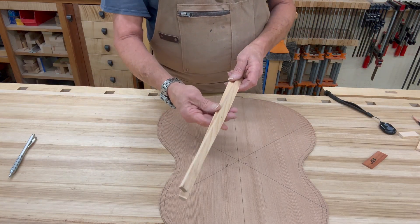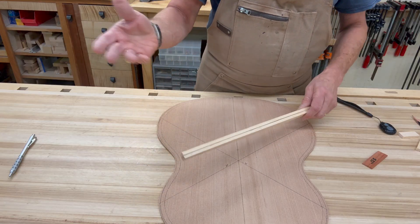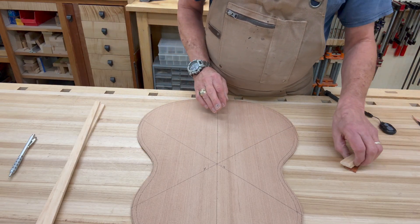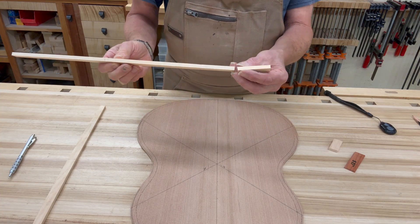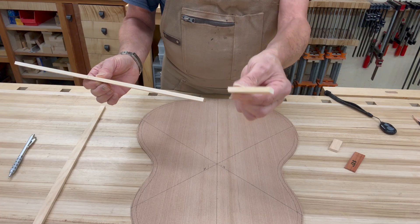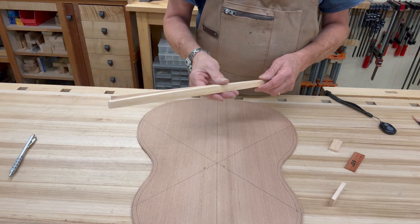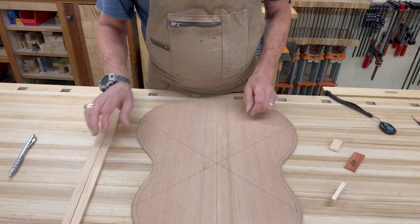Hopefully just much lighter lines so that they're easier to sand away or obscure by whatever means. So I have made a pair of X braces here, and I have them already arched to the doming that I expect to do, or perfectly flat if that happens to be your preference. Now what I'm going to do is cut a half lap joint on the table saw, and it relies on just two simple concepts. The first and most important one being that whatever the material thickness is that you have for your braces, you want to get that to your desired thickness and take a scrap and cut it off so that you have this scrap piece exactly the same thickness as your brace stock. It is imperative that the two braces be exactly the same thickness, so you'd want to drum sand those out or saw them out at the same time. Or if you're confident enough with a hand plane, you can hand plane them to the same thickness, and you'll be good to go.